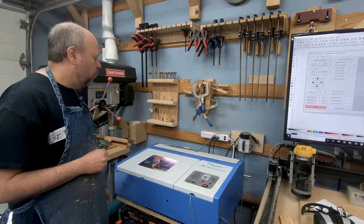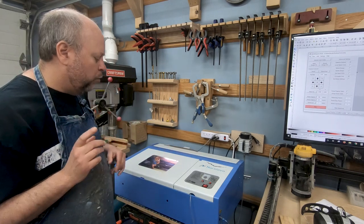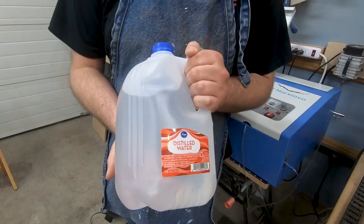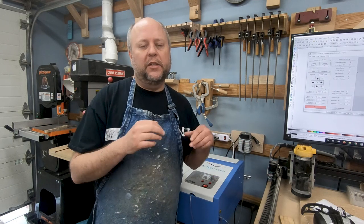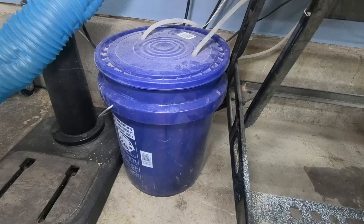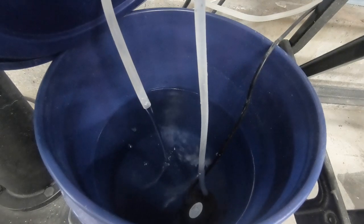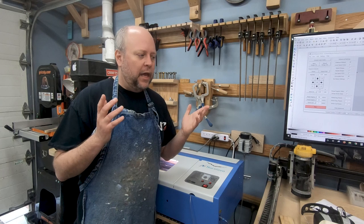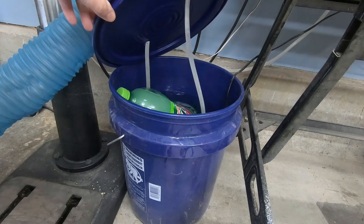You'll also get a water pump, which keeps water cycling through the laser to keep the laser tube cool. What you have to provide is a bucket to hold the water, and in that bucket you're going to put distilled water — it's important to use distilled water. Tap water has a lot of minerals that cause arcing as it goes through the laser tube and will reduce the life of your laser. I drilled a couple of holes for the inlet and outlet of the submersible pump. To keep the water cold, I get two-liter bottles, freeze them, and drop them into the water bucket.